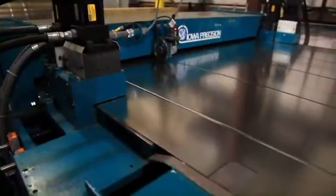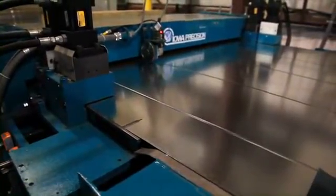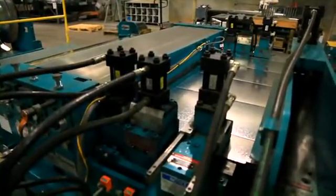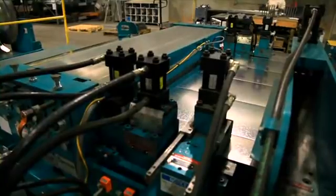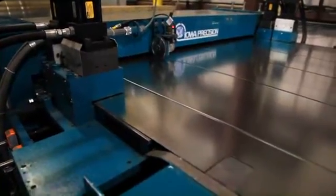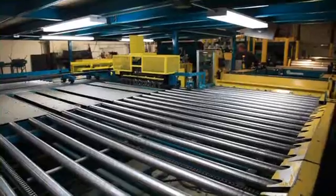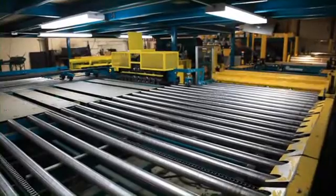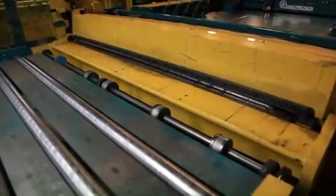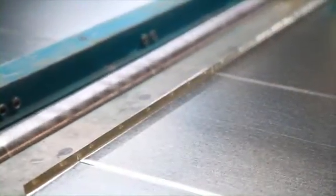The notching units are made up of solid die blocks actuated by standard hydraulic cylinders, designed to last the life of the machine — there are no sleeve bearings to wear out, which are common in post-type die set systems. The notches are sized to provide an extremely small open area to substantially reduce air sealing requirements. The cleat roller will roll 180-degree hems on L-section or wrapped duct; if slip and drive connectors are needed, the part passes through the cleat roller without being formed. The cleat roller system is hydraulically actuated for smooth, positive forming action.